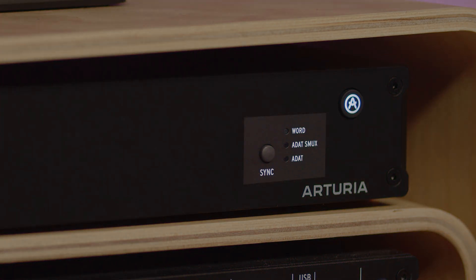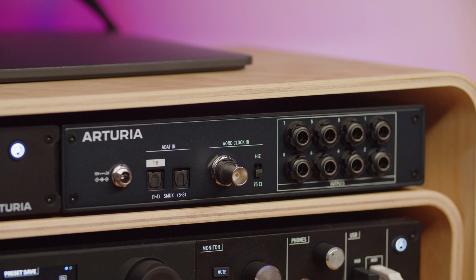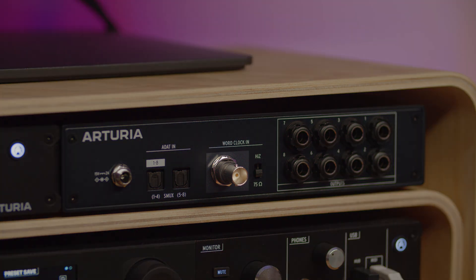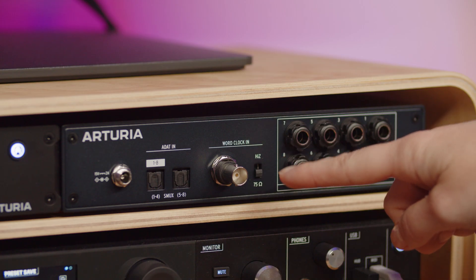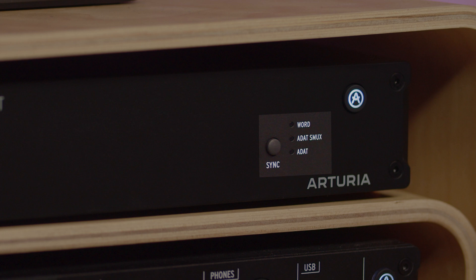It's good to know that ADAT outputs are always synchronized to the chosen sync mode. You can choose the sync source on the front panel with the sync button. AudioFuse X8 Out also provides word clock input on male BNC connectors. This connector is needed in order to use the word clock function. This feature ensures synchronization stability when two devices are connected together to extend the range of inputs, allowing you to avoid latency or audio glitches and clicks occurring while the signal is converted from analog to digital and flows between instrument, expander, and the interface. Word clock input impedance is 75 ohms or high Z, which can be set from the rear panel. Note that the 75 ohms option should only be engaged when the unit is set to sync to the external word clock and it is the last device at the receiving end of a word clock cable.